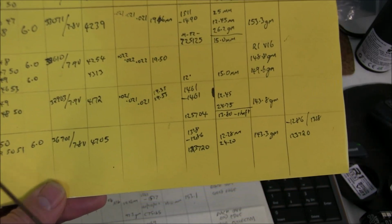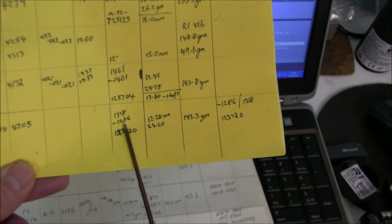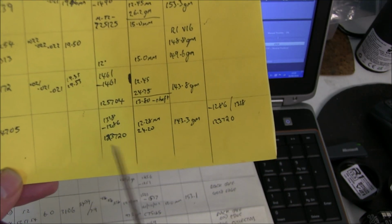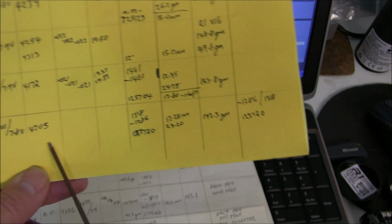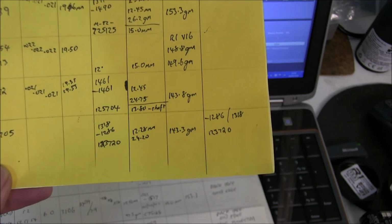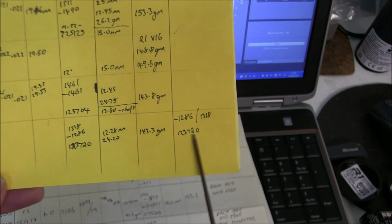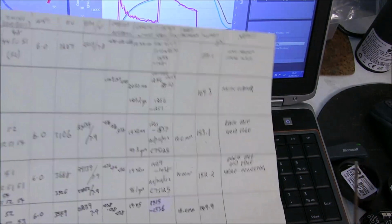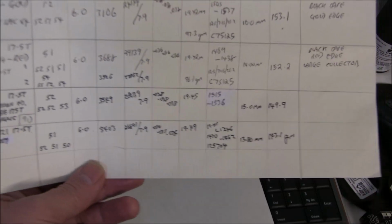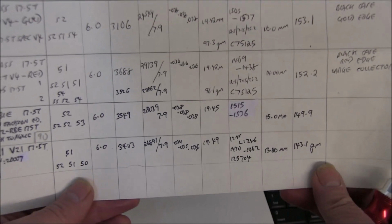Well, the optional rotor, very high kV, much weaker magnet. So I wouldn't recommend it for indoor or small tracks. You can probably gear it to get the extra high speed, but I wouldn't bother, but you might want to if you're allowed to under the rules. So that's the 13.5. The 17.5, I didn't put the optional rotor in this, but let's look at the results. It's quite a different sort of result.